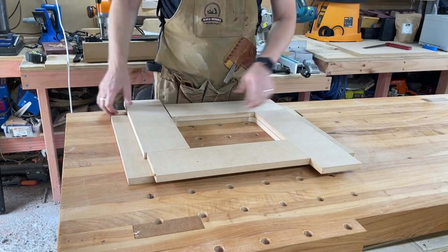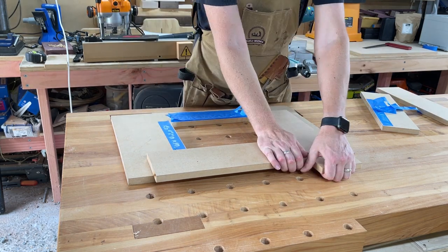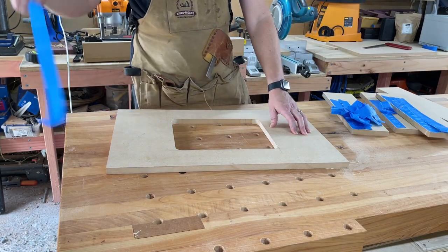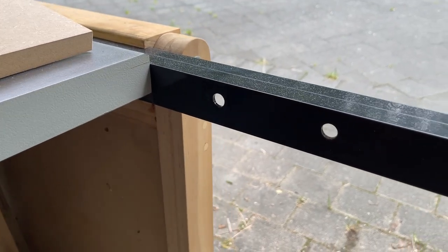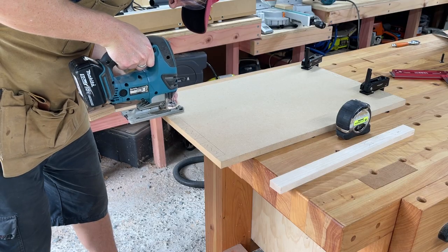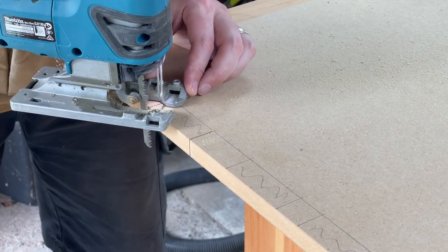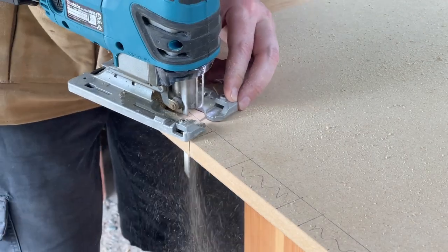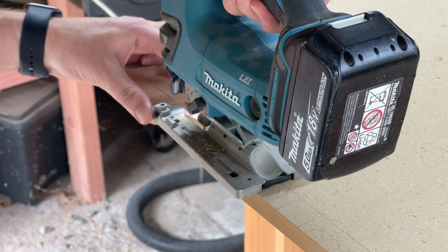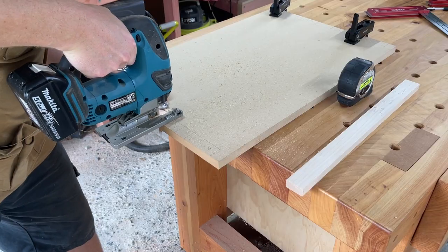With the area for the insert plate all cut out I can now remove the guide pieces and the blue tape. We're going to run into some issues when we try to attach the table to the saw, as the table will be thick enough to interfere with the bolts that will attach it to the saw. To deal with this I'm going to cut out some voids on the bottom piece of the table, giving enough space for a bolt to fully fit through and also giving me enough room to get a spanner in there to hold a nut in place when I'm bolting everything together.